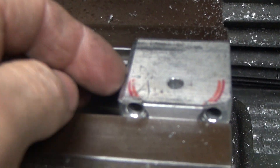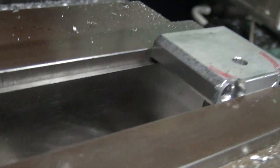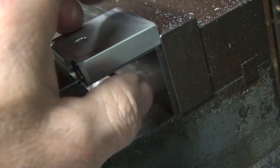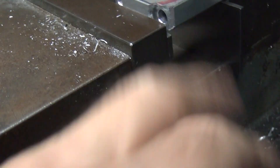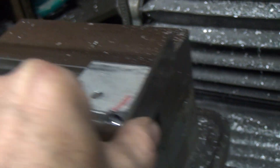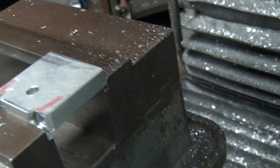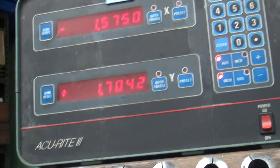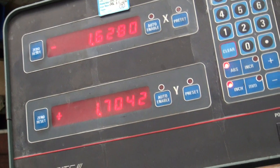We're doing the machining on this block — putting these chamfers on right now. This is tilting up on me a little bit, we'll get a gap on this side here in the parallel — this other one's down nice and tight. Not much to hold on to with that chamfer. To put these in square, you put the parallel on the outside edge so it repeats every time and you get a nice even chamfer all the way around. We got our stop set up, locked in, and our number over here is 575. We haven't cut this one yet so we're going to do this at 600.